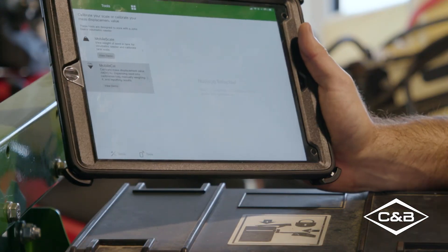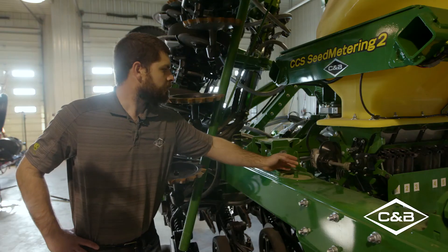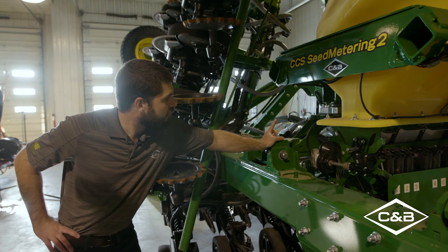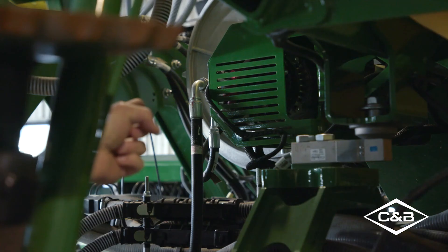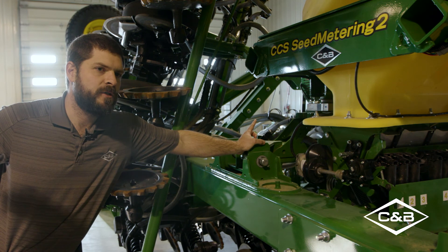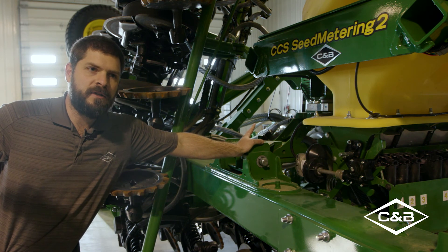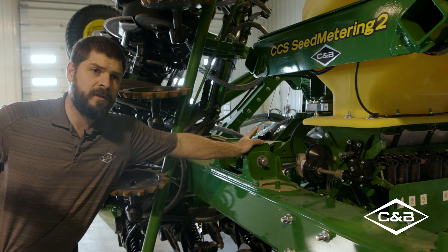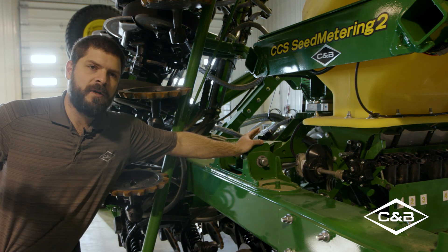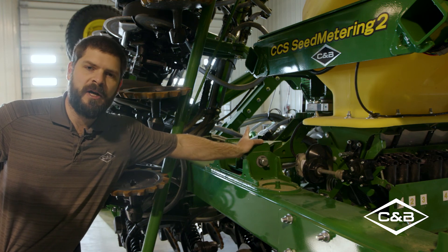As long as you have an iPad or even your mobile phone, everything can be done from back here. Here we have one of our electric drives that runs the whole meter setup, powered by the onboard hydraulic generator right there. I particularly like the way this machine is set up because the other option is a tractor-mounted power generator. This one is hydraulic, and even though it has this hydraulic power generator, the minimum SCV requirement for this tractor is three — it doesn't add another SCV to the minimum requirement. It runs off of Power Beyond, so if you don't have a Power Beyond on your tractor already and you have three SCVs, the only thing you'd have to add is a Power Beyond kit.